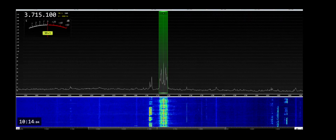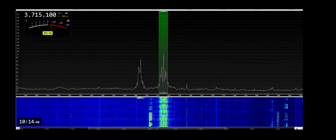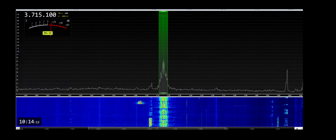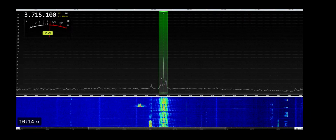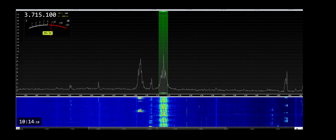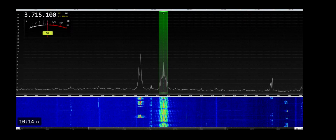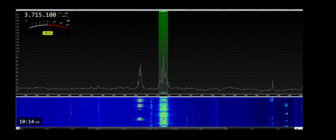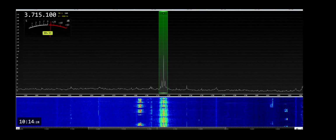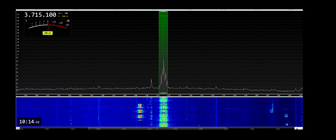So, and the other thing I was going to comment about the lack of power control in a 1950 Elmac. The first thing I thought of back then was nobody amplified an AM signal back then because you needed a linear amplifier, and that was just starting with single sideband. So all I was thinking about there was using an Elmac as a CW driver with a final with a plate modulator on it.